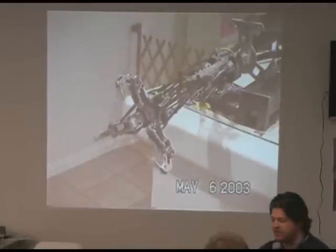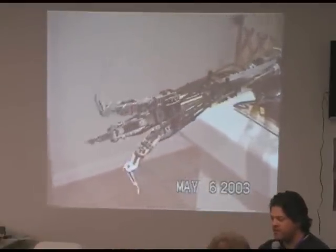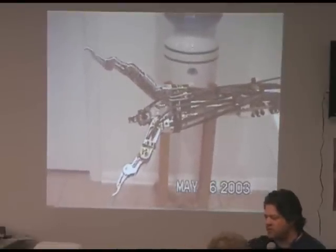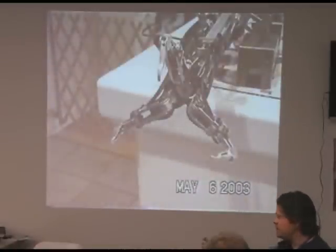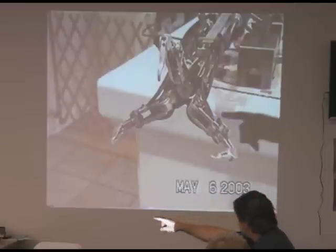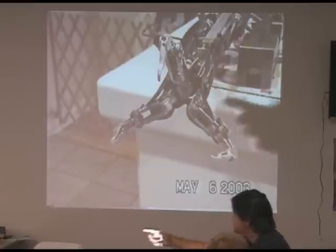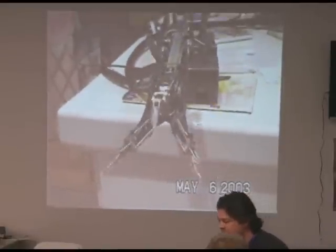We could build a telemetry glove so they'd be independent. The idea for this claw was not only to grab his glasses or a cigarette, but he was going to bring these fingers up into position like a human hand and play the piano like a mad scientist. This is a triangular grasping technique. If you have a spherical object, all six surfaces can grab and hold it nicely. If you put a pipe across there, the top finger holds well but the edges are loose, so we added rotors for a pipe-grabbing mode.